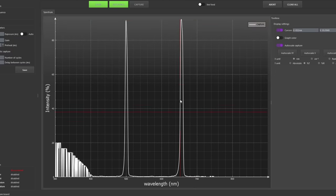Now let's look at the full width half max. It's probably like 52.5, right? And we're going up to 60.5. So that is 8 nanometers, or if we're a bit pessimistic, maybe 8.5 nanometers. So again, it's not quite 7 nanometers, but it is very close to spec and it is perfectly centered. So yeah, it's not quite 7 nanometers.